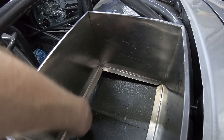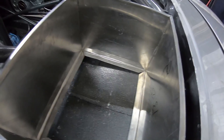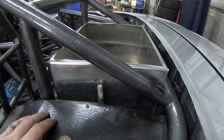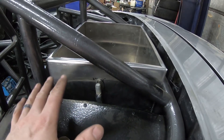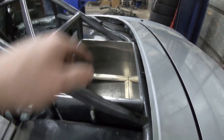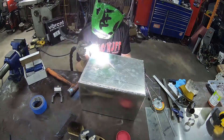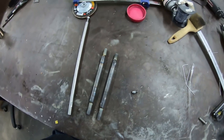The other thing I didn't notice was that the floor has just a few degrees of slope. So I need to build a front standoff plate to support that front edge, and build a bottom in here to support the box instead of relying on the frame contact. Our standoff slots are still marked, so the box will drop in with the battery tie down on it, you tighten the bolts down, and the batteries plus the outer box are locked in place. The lid will still be accessible to service the batteries.